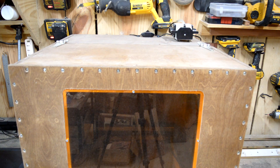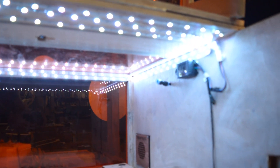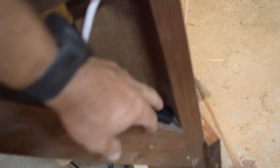For the portable Clack Shack, I've got a little dead-end coupler right there. I've got my air assist underneath the table on a little shelf where my battery backup sits. The switch is going to get mounted right here — you can see it turns the air assist on. I went ahead and put this little adjustable valve here so if I want to change the amount of air pressure I can back this little nut off, turn the pressure down, or even turn it completely off — though I don't want to do that and damage the pump.